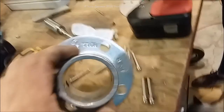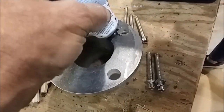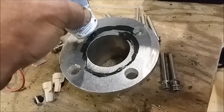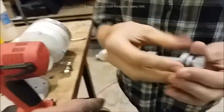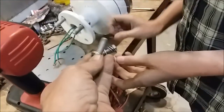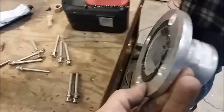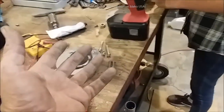All right, now we've got the holes drilled out nice, and I gave them a little side angle with the drill so they're nice and clear. We're going to put a little bit of RTV — just a little bit — on the inside of this fitting right here, just to keep it from getting a little leak down towards the wiring. It'll squish out pretty good. She's working on getting the bolts all set up and putting them in the PMA, having them ready for the mount that will go on the pipe. This will just drop down onto it. We'll have a 12-gauge extension cord wire — just regular outdoor extension cord wire — attached to the PMA and down the pipe so we can have the attachment finalized for install up on the roof.